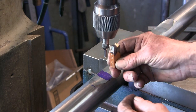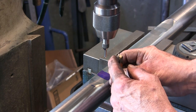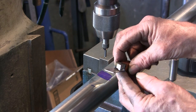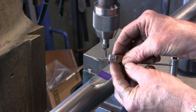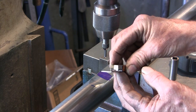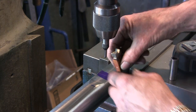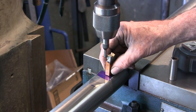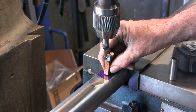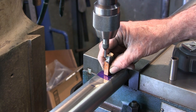So the hole offset is going to be coming this way so that we can keep this on center or above center. Now sometimes the leading edges of your tool bits aren't quite even with the top side of your square or your shank that it mounts. They're brazed on, and sometimes they're back or down a little bit farther. So you don't want to go any farther than half of your thickness there. In fact, it's almost preferable if you go slightly less than half of that,